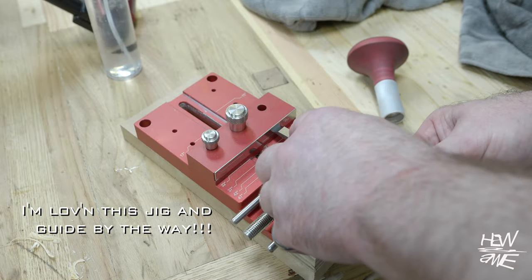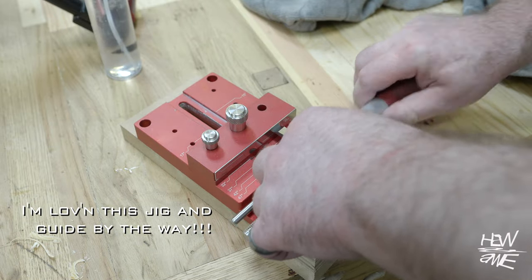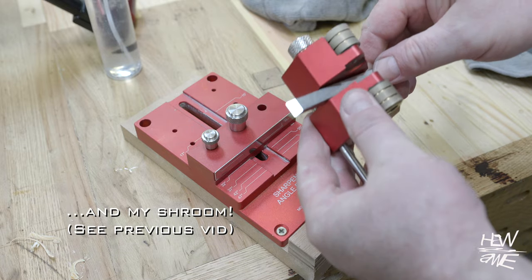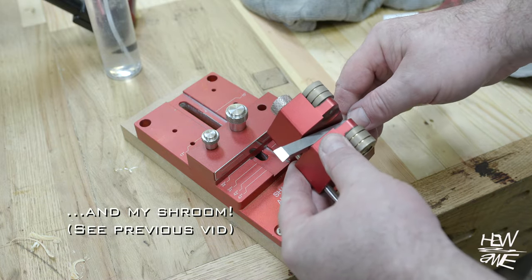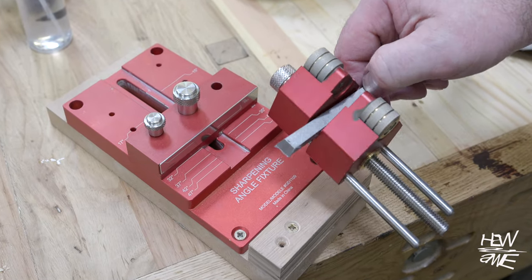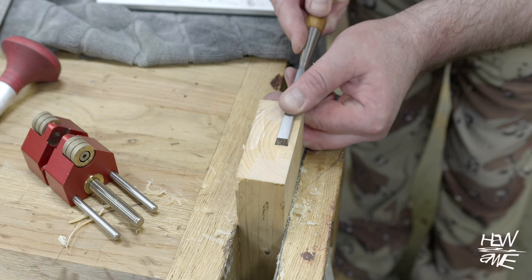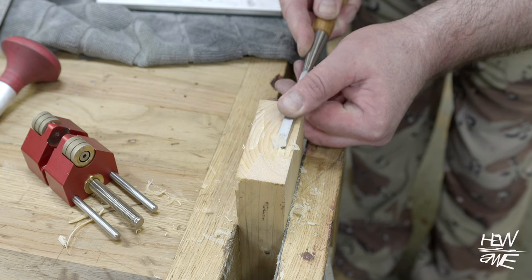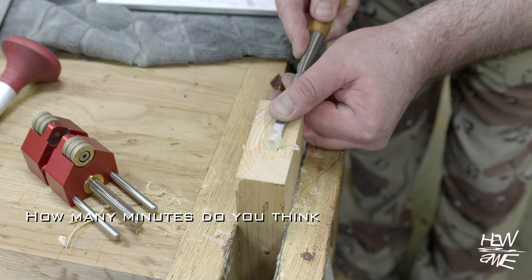The thinking here is I still have the same durability as usual, and the edge will remain good for the same amount of time, right? Just to show you, it's the same chisel though, before I go and regrind it. And with the magic of TV, that's been reground and honed all the way to 8,000 grit.